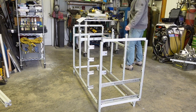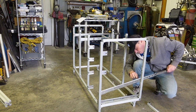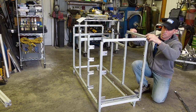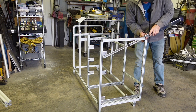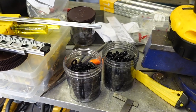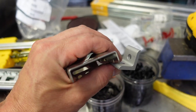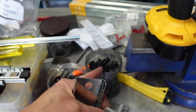Alright — wrong, this goes in first. We get to do it four million times more, feed into slot B. We ran into a couple of problems. These bolts and T-nuts are meant to go for aluminum corners and not the thin stainless steel material here, so they're about 3/16ths of an inch too long.